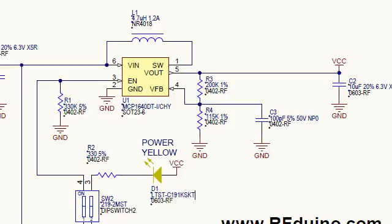For example, if you're running LEDs, even dropping by a couple hundred millivolts means those LEDs won't be as bright, and some other electronics may not run below 3 volts well. However, the RFduino can run all the way down to 2.1 volts without a problem, so you can directly connect two AAA batteries, AA, C cell, or D cell batteries if you want to run for years. You can even use a 3V coin cell battery directly to the RFduino and it will run just fine. This regulator is purely for convenience so you can run off batteries without worrying about voltage levels dropping too low for other shield circuits. It's a switching regulator, so the efficiency is quite high.